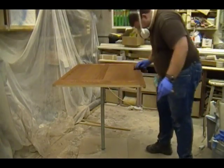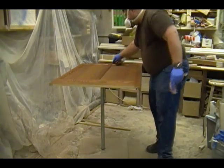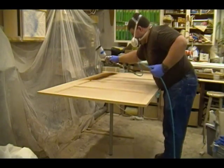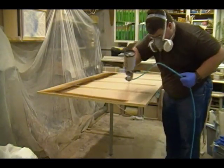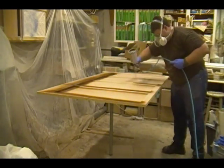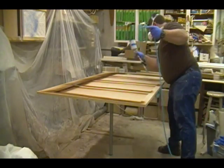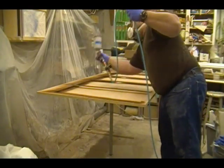Here I'm doing the final detail cleanup, making sure there's no excess stain left in the corners and no streaks. Now I'm spraying one of two front panels for this cabinet surround project, and I'm spraying stain into the corners of the panels to get stain underneath the styles and into the grooves in the styles and rails — in case anything expands and contracts, so there's still stain coverage even in hidden areas. Even if it's a little heavier, it's better than having raw wood showing.